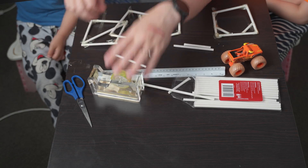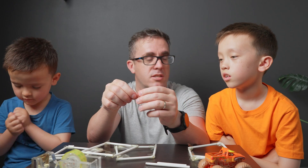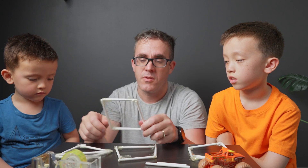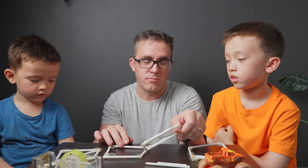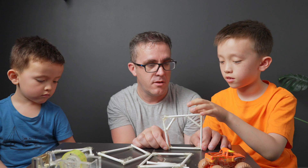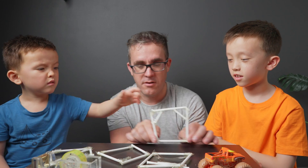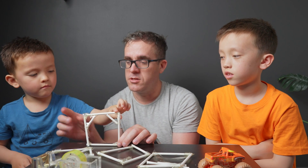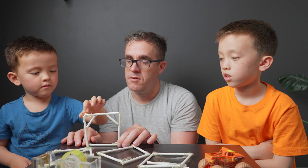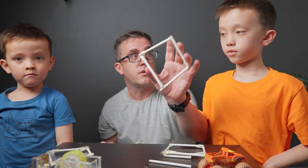With the cross brace, if I pull it taut I'm able to reduce the tension. But if I shrink it, it collapses — it has no strength in compression. That's why for the cross-bracing option we need two braces. This other type — when you try to push it over sideways — it's quite stable in that direction. That one's a bracing frame. So now we've got three options; the unstable box we put aside.